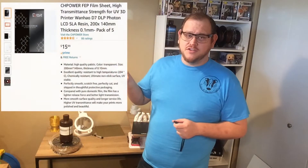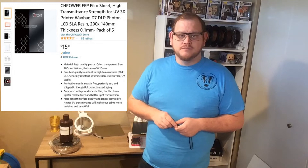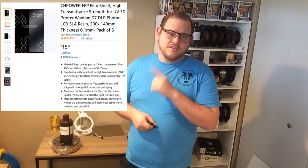The main consumable you'll have for your resin printer is FEP sheets. It goes at the bottom of the vat so that the light can come up through it and cure your resin. Here's a 5-pack for $16, so it's a little more expensive. But I would say if you're handling your resin correctly, these will last longer than a nozzle — just in my experience.